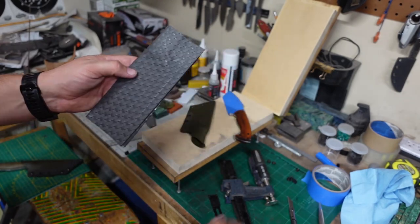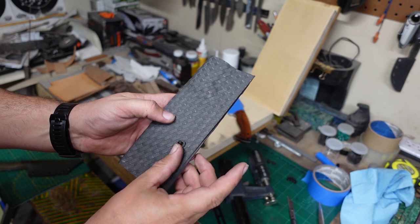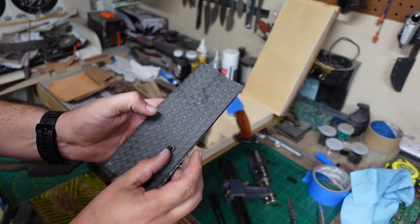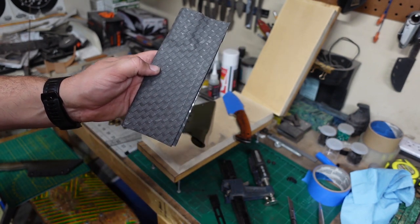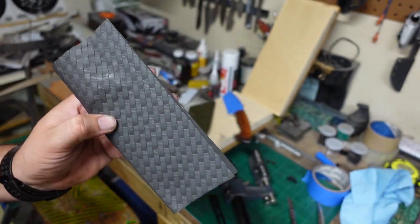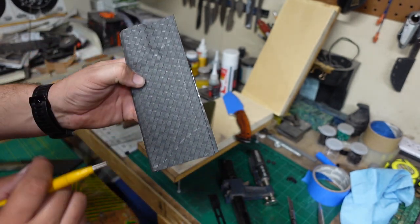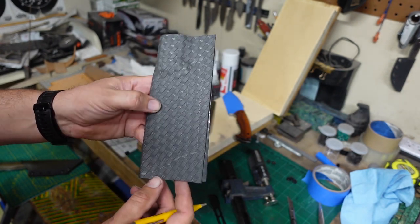So now what I'm going to do is take an eyelet, make sure we're nice and good space-wise there, and we're just going to split the difference between this line and that line, which you might not be able to see very well. That line and that line. Split the difference between those. Measure out our holes. Start getting ready to drill in our eyelets.